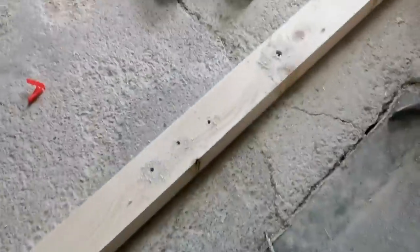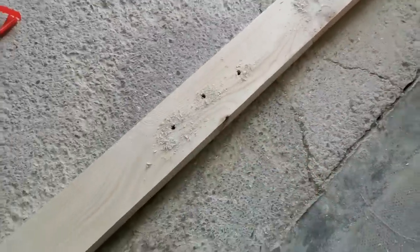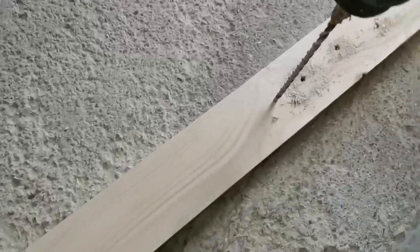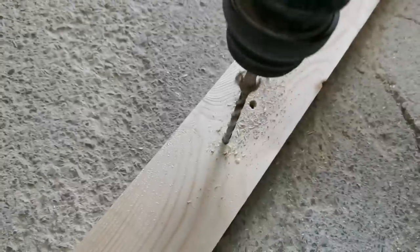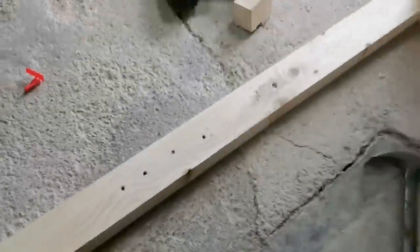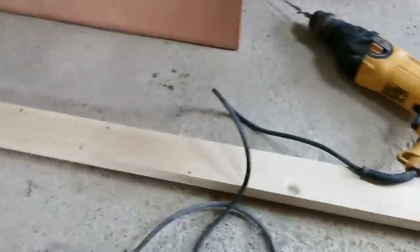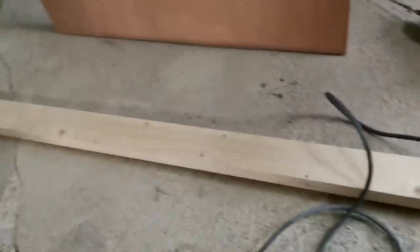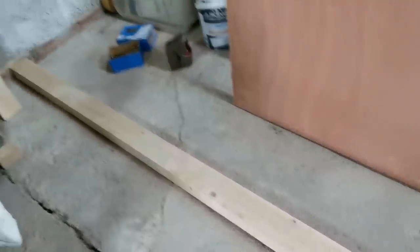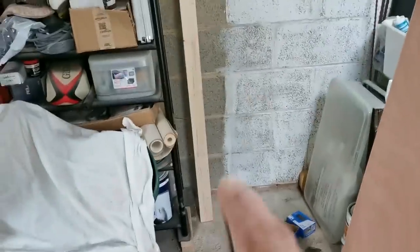This concrete's crap — it's only about an inch thick — so I managed to get a fixing in there. That's the timber. I think I'll get some studs in and then put screws wherever I can. It should stop it walking. First thing I'm going to do is work out that end and put a top leg down like that.